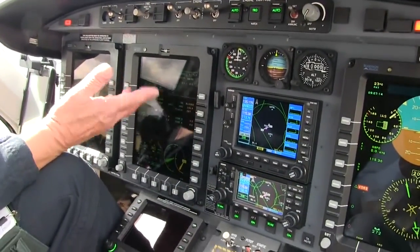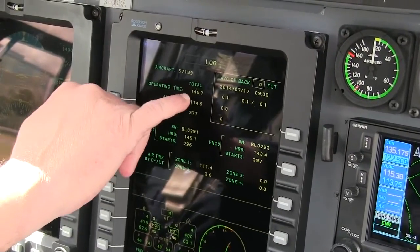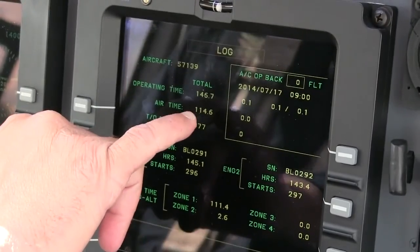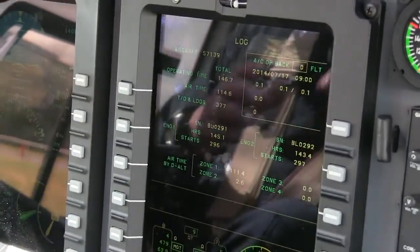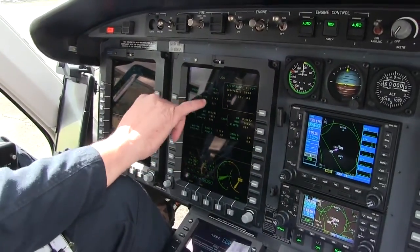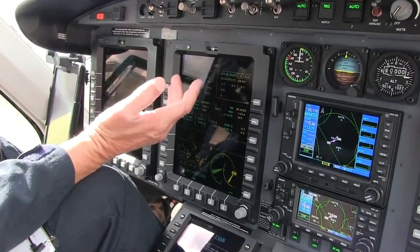Log data — again, for the pilot, this is a really nice feature because not only does it give the pilot and operators the exact time of airtime versus operating time. Operating time is basically as long as the engines are running, and that could be sitting on the ground. Airtime is when we're at 100% and we pick the aircraft up off the ground. We have what we call a weight-on-gear switch — it will actually start the airtime, which is what you base maintenance off of. Right now we're saving 30-plus hours of maintenance because everything is based off of airtime, which is saving us money.